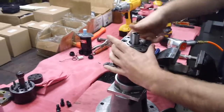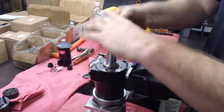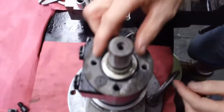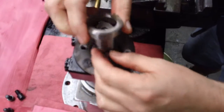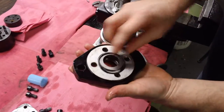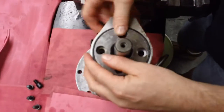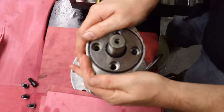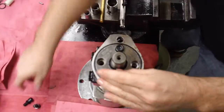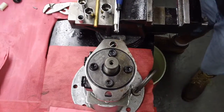When you lift this flange up, you've got to hold that shaft in place as it comes up. Hold that down, lift up, and keep all that there. You need this thrust washer right here — put it in your new flange. Put your O-ring in. These bolts here get torqued at 40 foot-pounds.